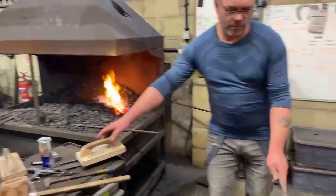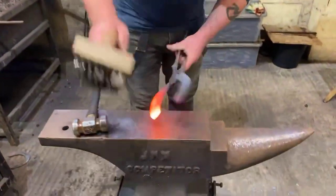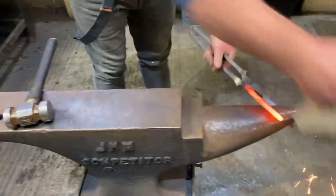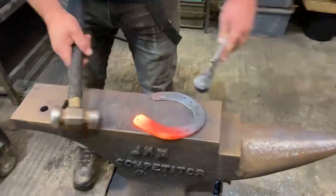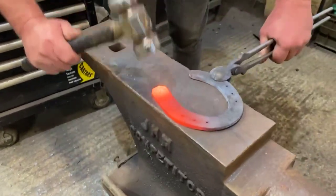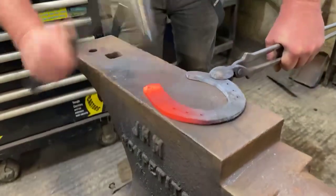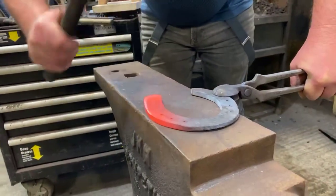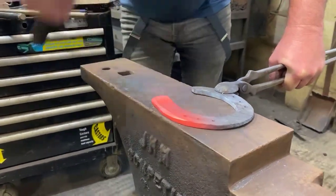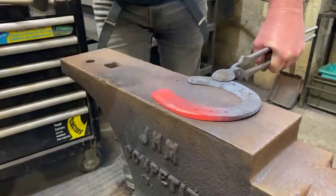And again, when we're hammer boxing, we don't need it too warm. Get a nice finish if it's a nice red heat. Okay, and all we're going to do, I personally normally start at the heel. So everywhere we box it and fit it with width, we just come in and take the edge off of the hammer, obviously round to the quarter, and increase it towards the heel.